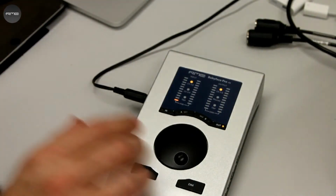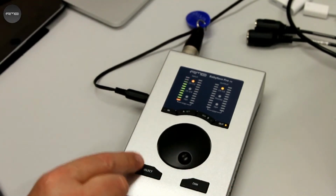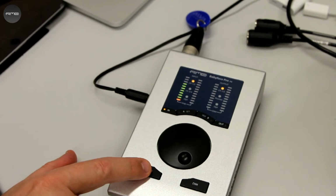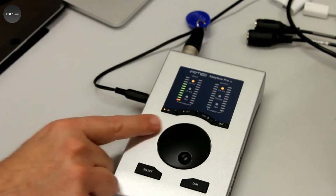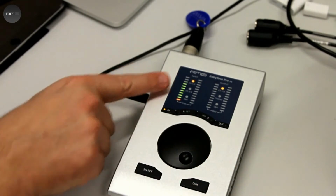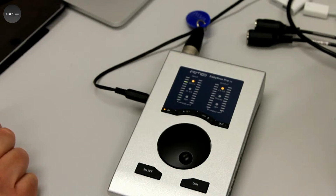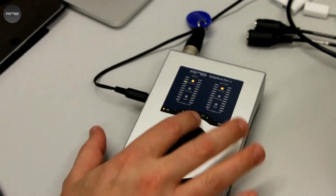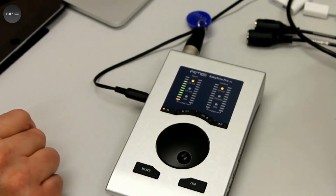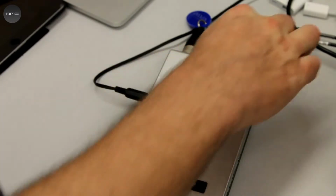So if I want, for instance, again my tone generator, and I want to give phantom power, I select my input part here, and this part is selected. Select, yes, this is blinking. I press set, and the phantom power is off, and the signal will go down. So all these buttons also have functions in standalone mode. Now if I switch the phantom power on again, I have a signal, and I want to send the signal to the outputs of the Babyface, so to the XLR outputs.